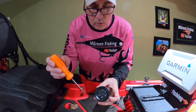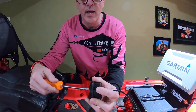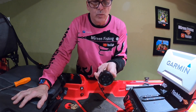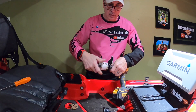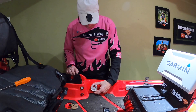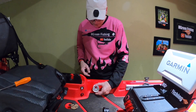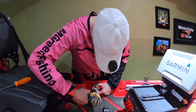Here's how this works: once you put it in the hole, you turn these screws and a little ear comes out that grabs the back of the plastic and pushes the unit in. The reason you want it to be exactly 2⅛ inches is because the tolerance is pretty small. I know I'm going right over here for the location. On this particular kayak there's actually a round section here, so make sure if you're installing this you stay off the round — you need a flat surface. I'm going to make the hole right here. That's where it's going to live.